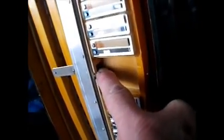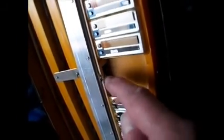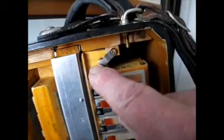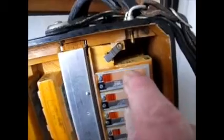And then when that slides forward, the brass slider here, which slides over the holes in the reed block, gets jammed on the wood. I'm looking at this one at the front here, but on the back block, this gets jammed on the wood there, and you can see it on the other one because there's a brass mark on the wood where it's been rubbing hard. So I'm going to replace this screw, put a slightly bigger screw in so I can get a proper firm pressure on that screw to clamp this reed block into place.